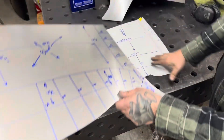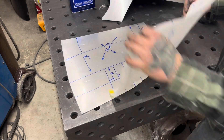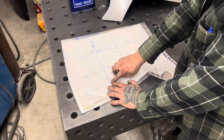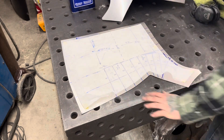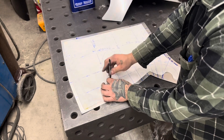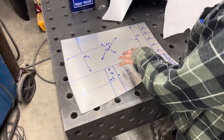Here I have the blank already laid out. This is the inverted side, so I took the same pattern I had and just flipped it over. How I get all these points lined out is I take a little automatic center punch, lay it on there, and I can just ever so lightly put a reference mark, then string tape across it and lay everything out with a Sharpie.